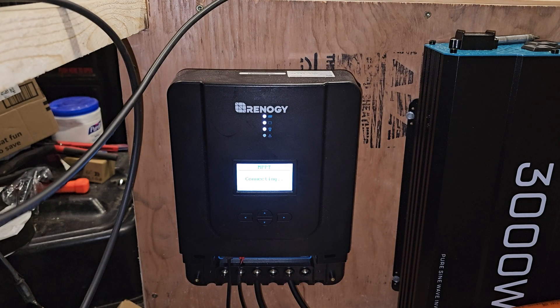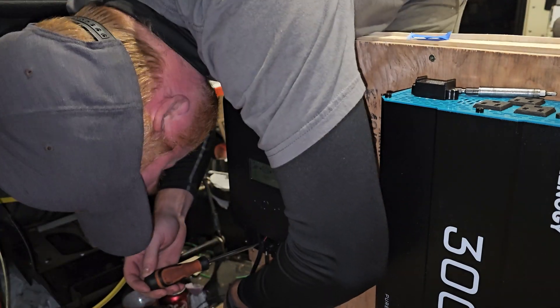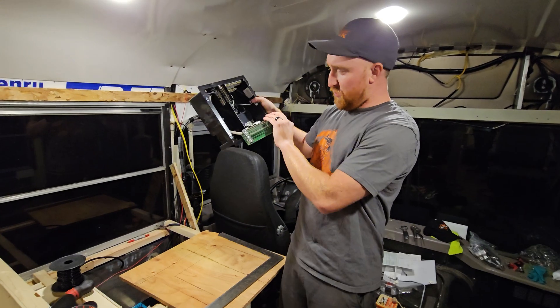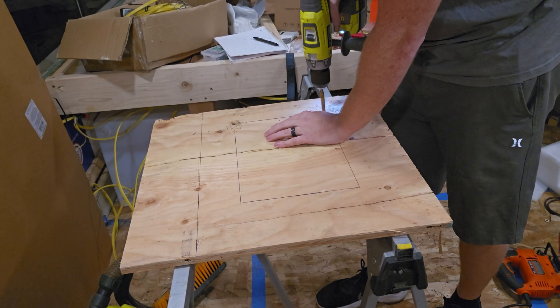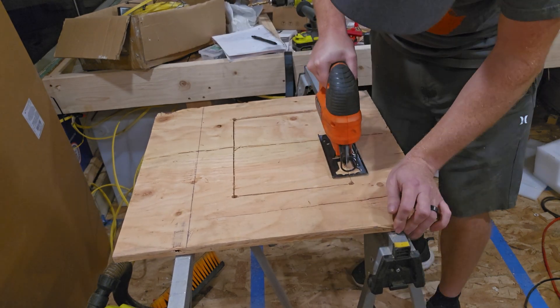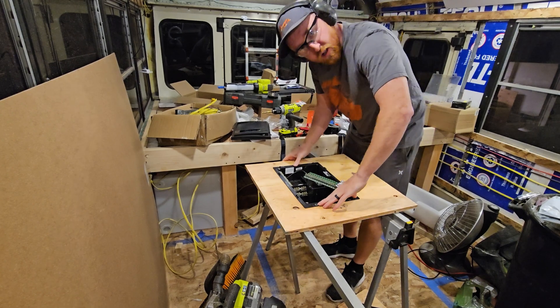Although it's currently dark outside and there won't be any solar coming through, it's always recommended to plug in the battery first before you plug in the solar panels — that way the charge controller is prepped and ready to receive power. For all of the power inside the bus, I have this fuse box, breaker box combination. I'm going to cut it out, mount it in here, and punch out the holes for all the wires — the 110 and the 12 volt lines that come into the back of this board, which will be mounted underneath.